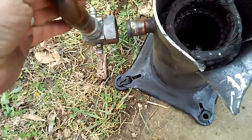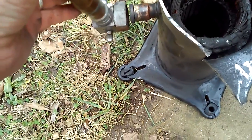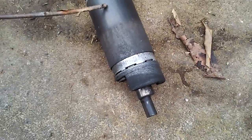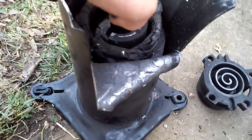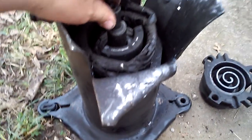There is a threaded hub that goes into the side of the compressor, which is not present right now. You can see some discoloration here between this portion and this portion on the armature. This goes down inside here. Counterweight here. Eccentric here where the scroll oscillates on — right here.